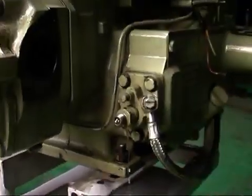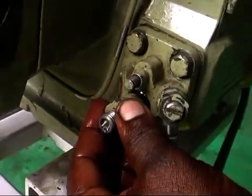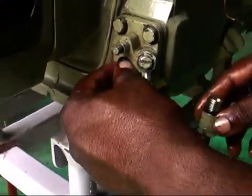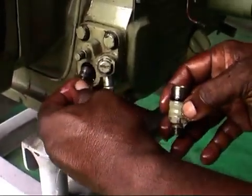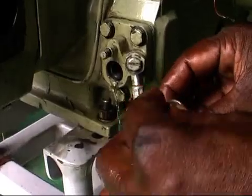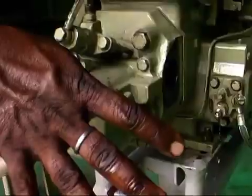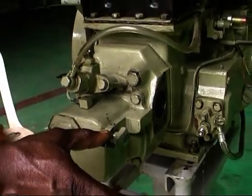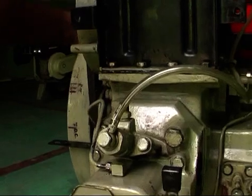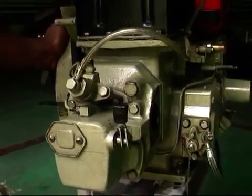Pump timing is important in the fuel system. Procedure for setting: first, open the holder of the delivery valve from the fuel injection pump, and after separating the valve portion from the delivery valve, reassemble the pump again. Then open the fuel cock and watch that fuel bleeding is continuous from the pump delivery valve holder. Then rotate the flywheel clockwise slowly till fuel bleeding stops.